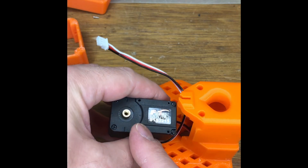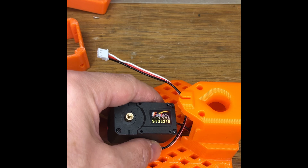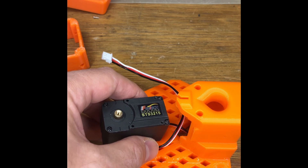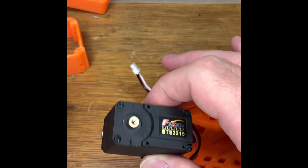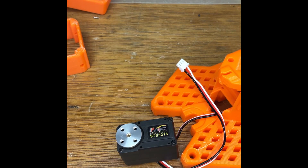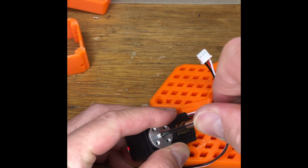On the follower, of course, this is powered so you're going to set it to be powered. Also set the angle offset to 1024, and that will now allow you to push on a driven servo horn and then screw it down straight away, as you don't have clearance to add these screws later and it would make the structure weaker in a place where it shouldn't be.